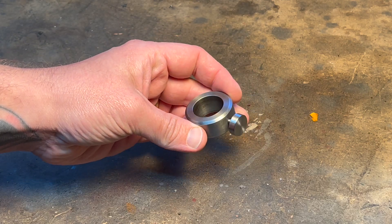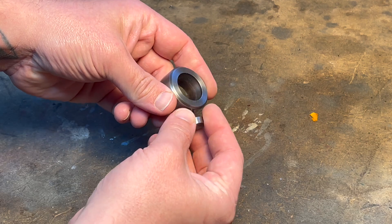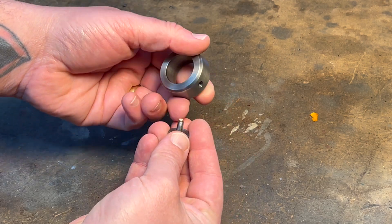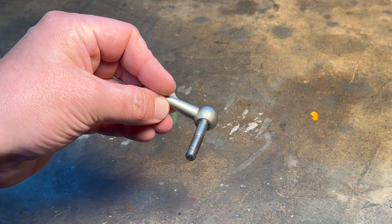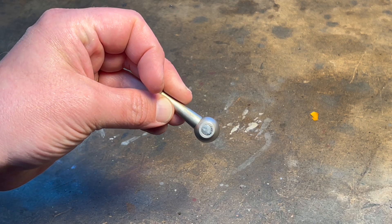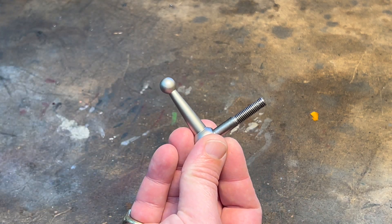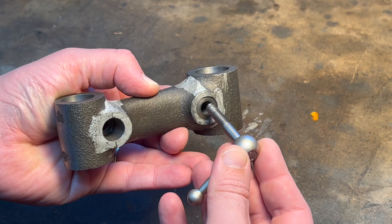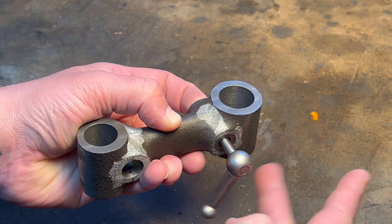There were a few projects which I didn't record the making of. This one is a locking ring - it's just a simple threaded screw there with a brass tip going into a ring with a nice bore through it. I didn't want to make a ball turning attachment just yet, so I bought in these handles and just loctited in some threaded rod to act as the shaft of the handle. And this is them going into the casting now - you can see it's engaging with those little brass plugs I showed you right at the start.